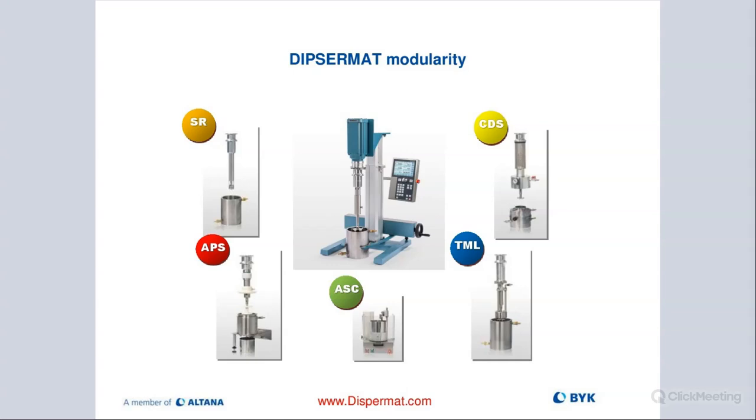But let's say I want to scale that up to a ton. That means I need 500 kilo of beads. Well, depending on the volume, right? If I have a 1 ton container, I put 500 kilo beads to 500 kilo slurry. That question becomes, how do I handle that? So maybe really great for lab and small pilot, but not really suitable for manufacturing scale.